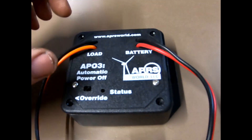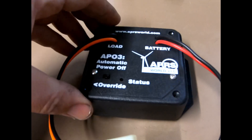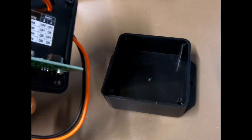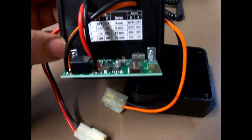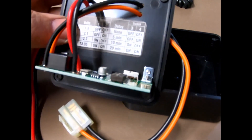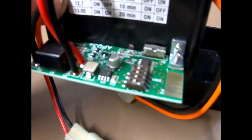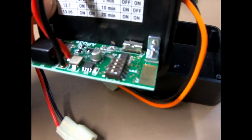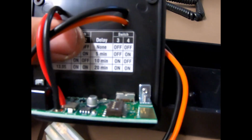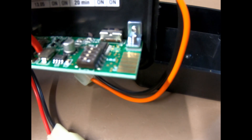To change your settings, you just take out these four screws here, the cover pops off the case. Here's your relay, and here it has the instructions. Depending on your voltage, you can switch these little relay switches. Over here is your delay — if you want none, you swap switches three and four to the off position.